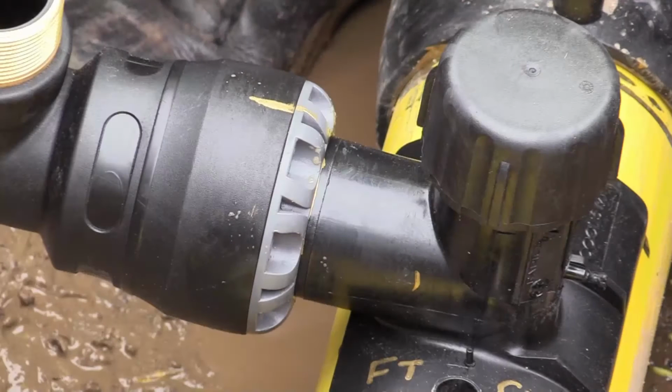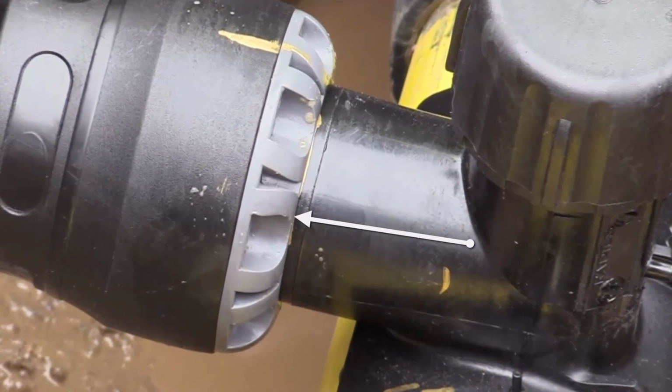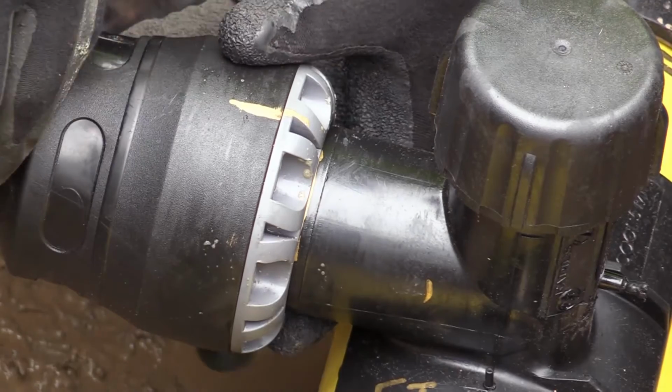In order to achieve a leak-tight application, marks on the locking nut and fitting body need to be fully aligned, and the minimal insertion depth previously marked on the tapping tee outlet needs to be reached. It should be noted that the fitting can still rotate but cannot be moved when a leak-tight application is achieved.